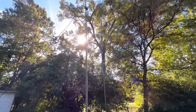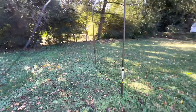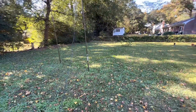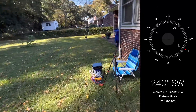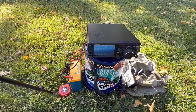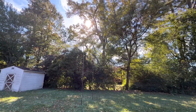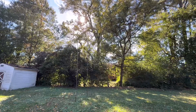That's the antenna — another backyard build. I've got about 30 feet of coax coming down from it and over to my radio. It's a little bright out here, but I've got it pointed 240 degrees southwest. We'll be operating today in the backyard with my Yaesu FT-710. That's the two-element vertical Yagi — a two-element beam using a director. Let's get on the air.